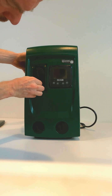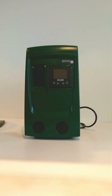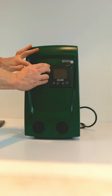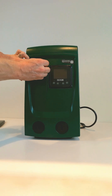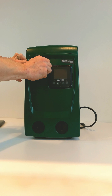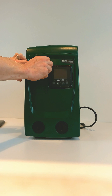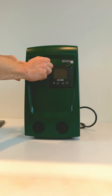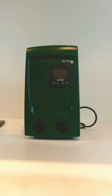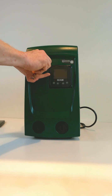If the pressure setting on the pump was 35 psi, that would be fine, because you want the air pressure in your expansion tank to be approximately 15 psi below your set pressure. If your set pressure was any higher, then you would want to increase the amount of air pressure in your expansion tank.